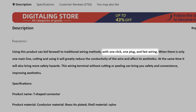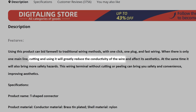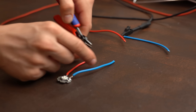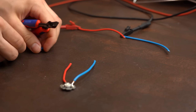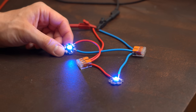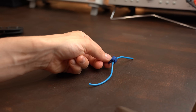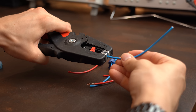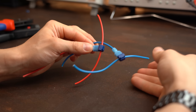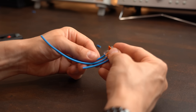They claim this one-click technique is not only fast but also that traditional wiring — cutting the wire, stripping its insulation, and using something like a Wago terminal — will greatly reduce conductivity. I immediately disagree that the T-splitters are faster, because for them I need pliers, wire strippers, and a crimping tool. With my Wago connectors I only need a wire stripper, so I feel it is twice as fast.